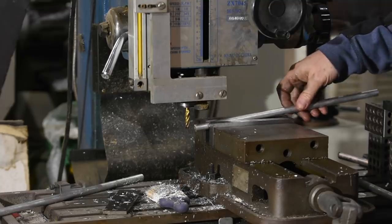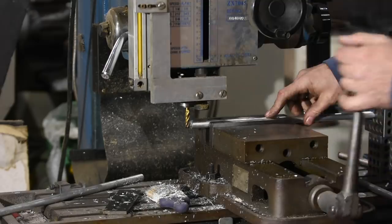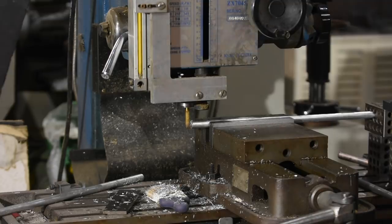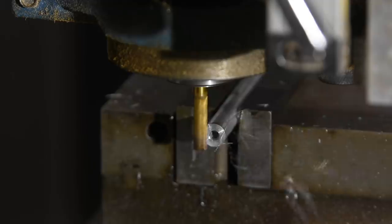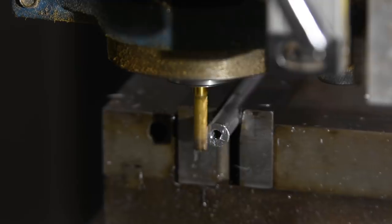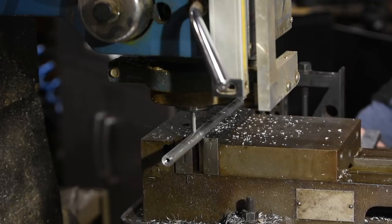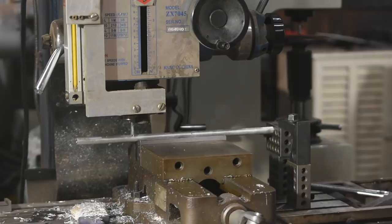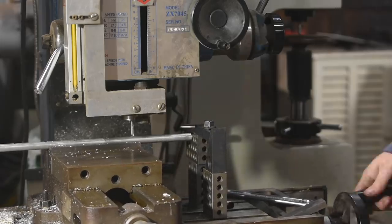I'll set up a little indexing stop on my mill and trim all four rods to the exact same length using a 1/4-inch end mill. Honestly, a lot of this is kind of gilding the lily — it wouldn't kill me if these rods were chopped off with a hacksaw and ended up slightly different lengths. But everything will fit together neater and cleaner this way. I'll also mill little slots in the top two rails so that if I hang rods from rail to rail, they won't slip, slide, or roll around, which I really want to avoid because it can cause parts to whack into each other.